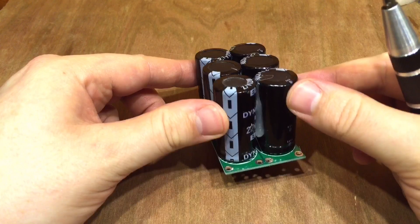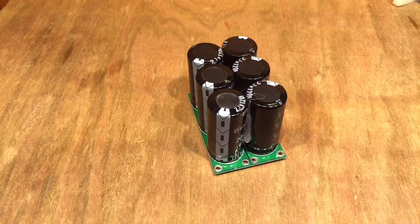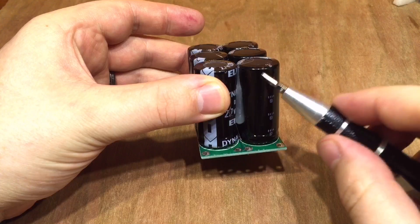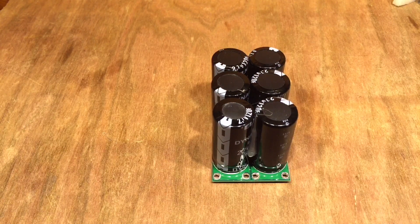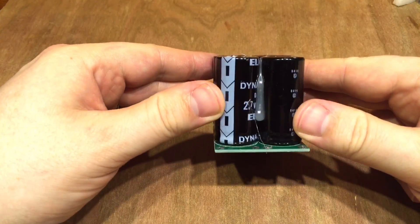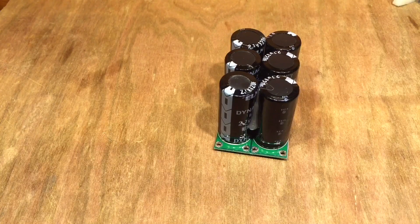It was Julian Eilert who pointed me in the direction of this module, but I have also heard of Dacian from Electro Dacus — he was using super capacitors to test his lithium-ion solar charge controller, because they charge up and discharge much faster than batteries do. With 2.7 volts per capacitor, this can take a maximum of 16 volts, and the eBay listing claims it's a 1 farad capacitor.